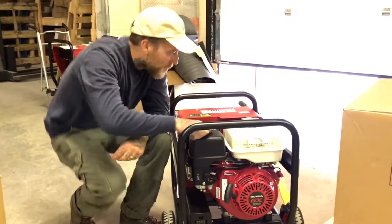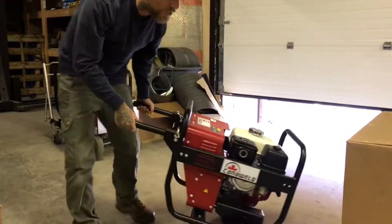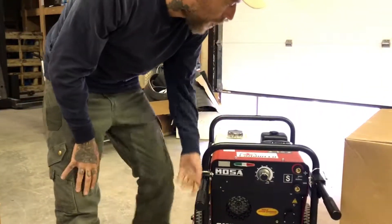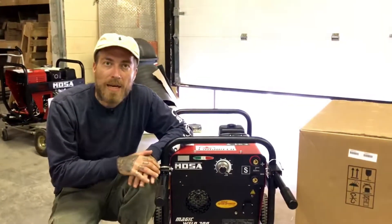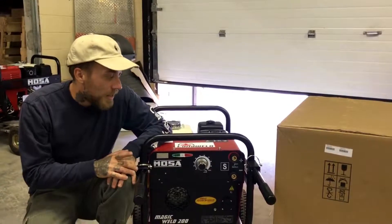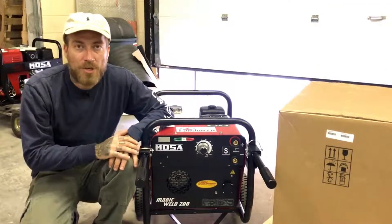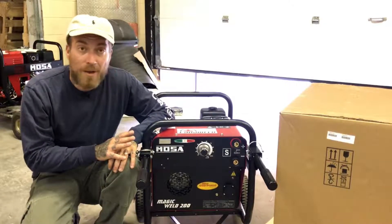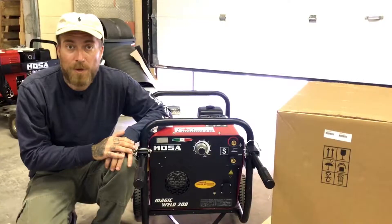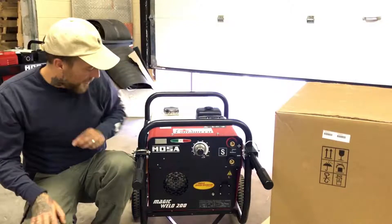So other than that, it's a pretty basic, sturdy, and pretty light machine. There's no other 200 amp engine-driven welder that's as light as this one — most of the competition comes in at least 80 to 90 pounds heavier. That's partly because these have a recoil start while some of the competition has an electric start, but the electric start is inherently heavy. I like to have the lighter machine — that's the whole point of having a portable machine. What's the point of a portable machine that's still 240 pounds? It doesn't make a lot of sense.